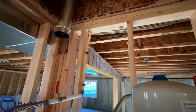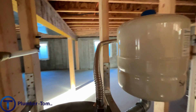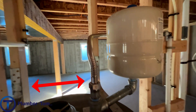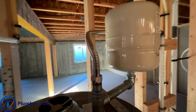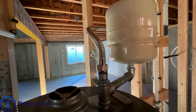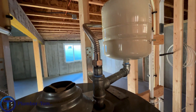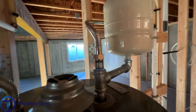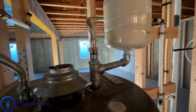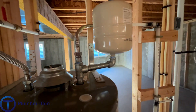The expansion tank is being supported by the pipe, which isn't technically up to code, but galvanized is pretty sturdy stuff — unless an inspector flags it, they'll probably be all right. The plumber set the tank at 60 PSI to match the pressure reducing valve, which ensures the expansion tank functions properly. There's also a shutoff valve on the hot side — not code-required but makes servicing easier. However, the earthquake straps are only at the top of the water heater. Code also requires a strap at the bottom third, so this doesn't quite meet all earthquake strap requirements — I recommend using an earthquake strap kit.